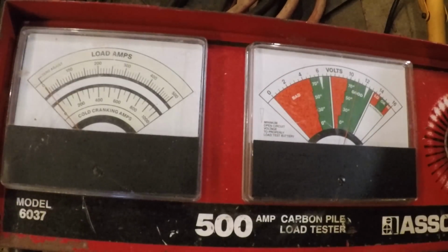And it's just out of circumstance that one battery is stronger than the other, so it went bad, or it wore on that battery, or shortened the life of that battery because it had a draw. So that's something else we'll check before we put it in. We want to put it in and make sure we don't have anything more than a very small milliamp draw. Like 30 milliamps is about what I'd like to see, or less, and that should be adequate for that truck. So that's that, and we get this all unhooked.